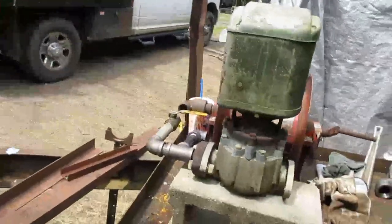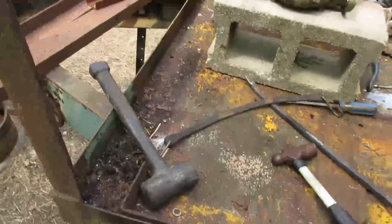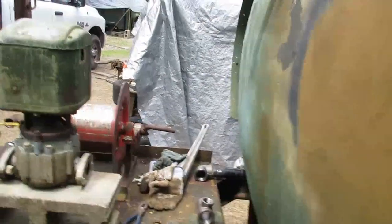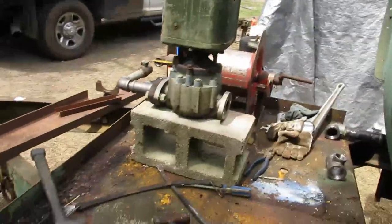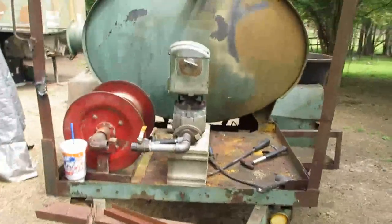I'm also going to put a hand pump on here so I can pump by hand to fill it up. I'm going to put connections on there as well because I have a 110-volt pump and a 24-volt pump, so I can use either of those - just setting them on here, connecting to a discharge and suction, still running it through the whole system. I can suck it out of the tank and run it through the filter, meter, and hose reel with either electric pump. I'll have basically four ways to take fuel off: the diesel pump, the hand pump, 110V electrical, or 24V electrical.